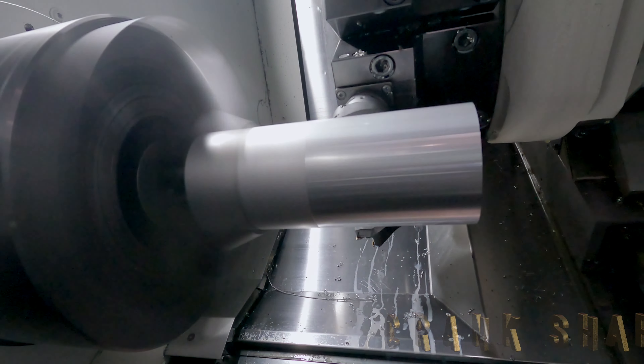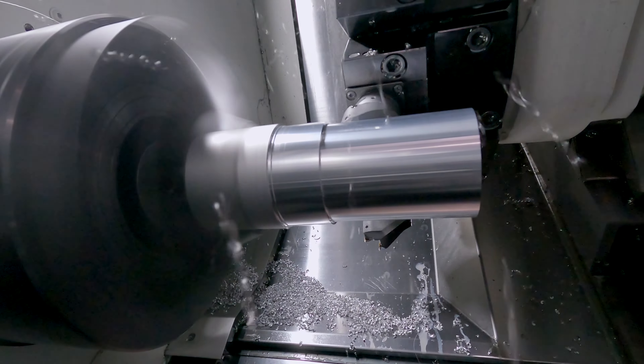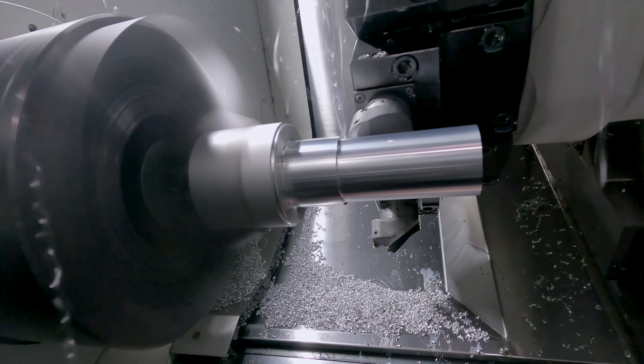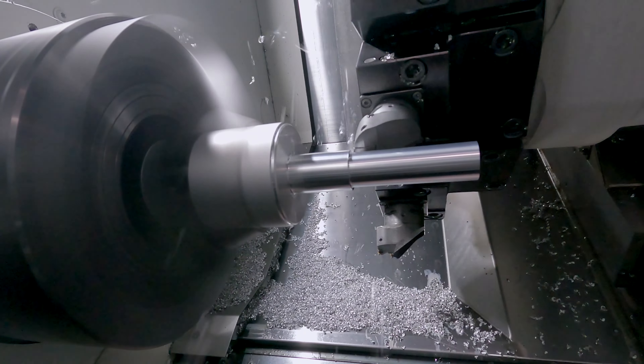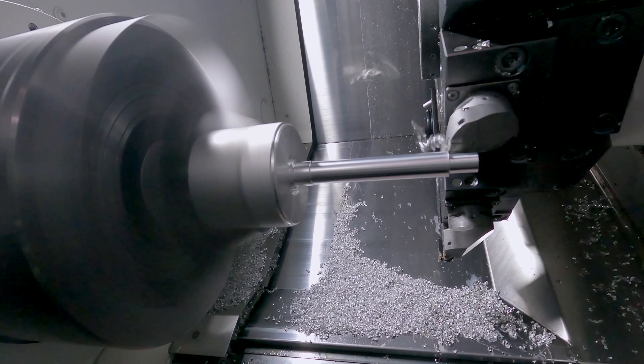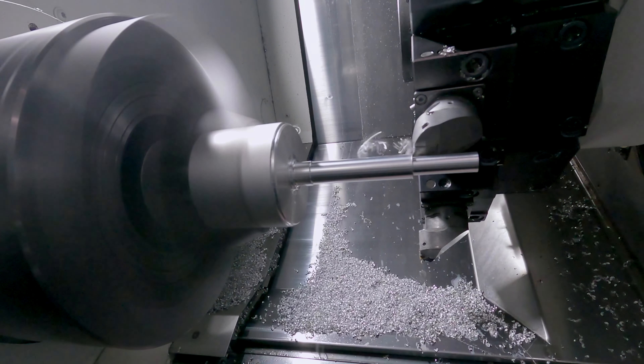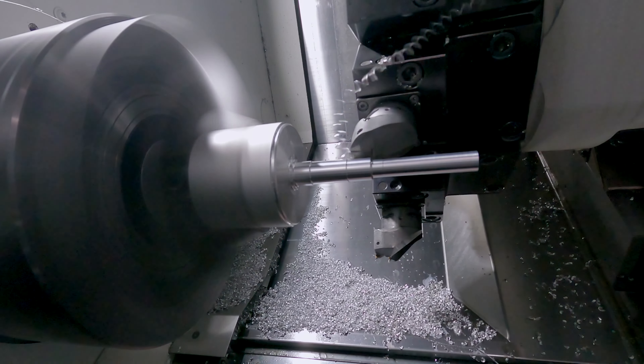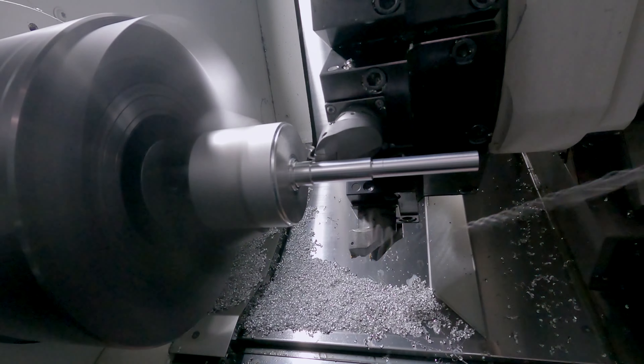Crank — tell us about that and any issues that might have come up. Didn't use the tailstock, so just ran second passes. Essentially there's two bearing journals, a keyway that times it with the planetary gears, and then a thread on the end for the nose cone that holds a prop on there.